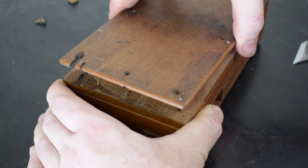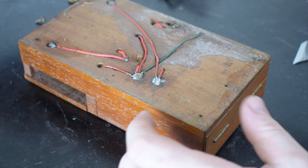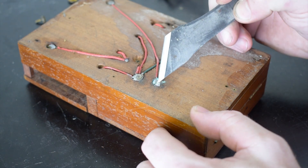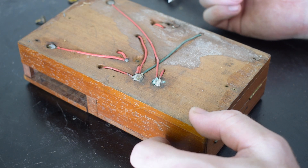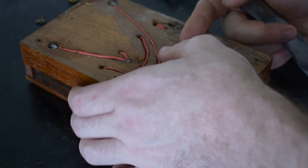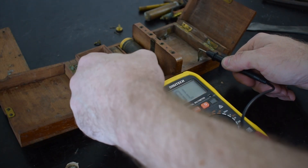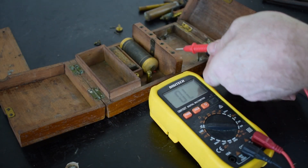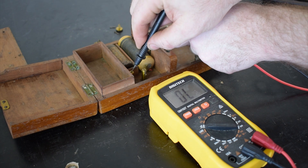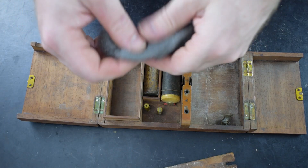More glue and signs of newer wiring. This has been re-wired at some stage, or possibly the old wires have been insulated for safety. It seems they have just placed a lot of solder on here to join all the parts together, instead of using the original screw-type terminals that would have been in place underneath. I also really hope that this has been wired up correctly, or otherwise I don't have a chance of getting this thing working again. I do some continuity checks with my multimeter to make sure that things that look like they should be connected, are. The beeps are actually a good sign. These parts are given an initial clean so I can make sure that there are good connections.